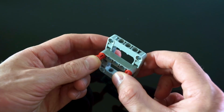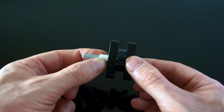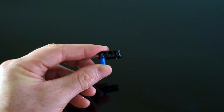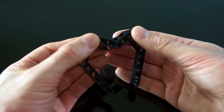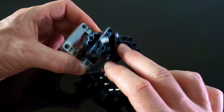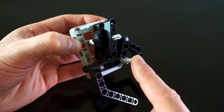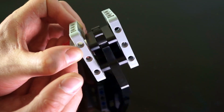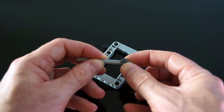So, let's start with the timing mechanism. I'm not patient enough to build those incredibly delicate escapement mechanisms that expert builders use in their clocks. But I sure can brute force a crappy mechanism that works just good enough. This is the piece that I'll use to allow a bit of movement, and then it'll block itself from completing a full rotation. This gives us that tick-tock mechanism that you see in clocks, but way more basic.